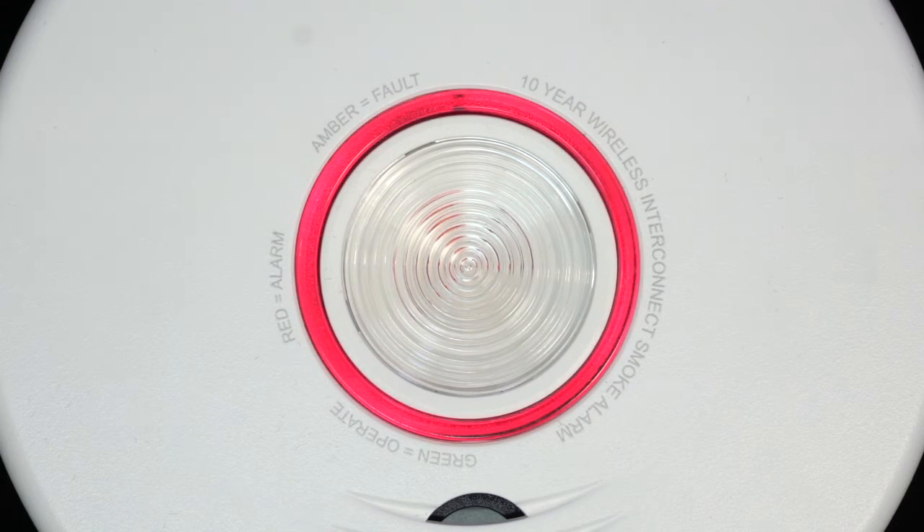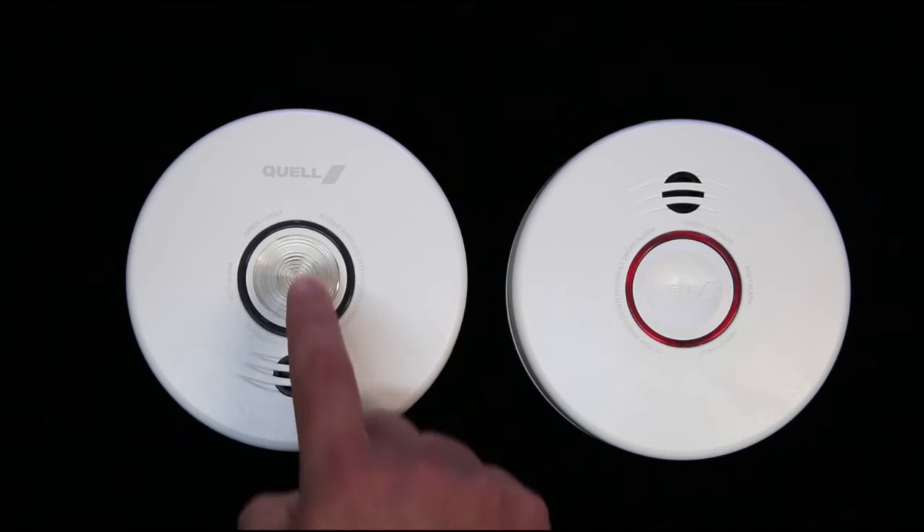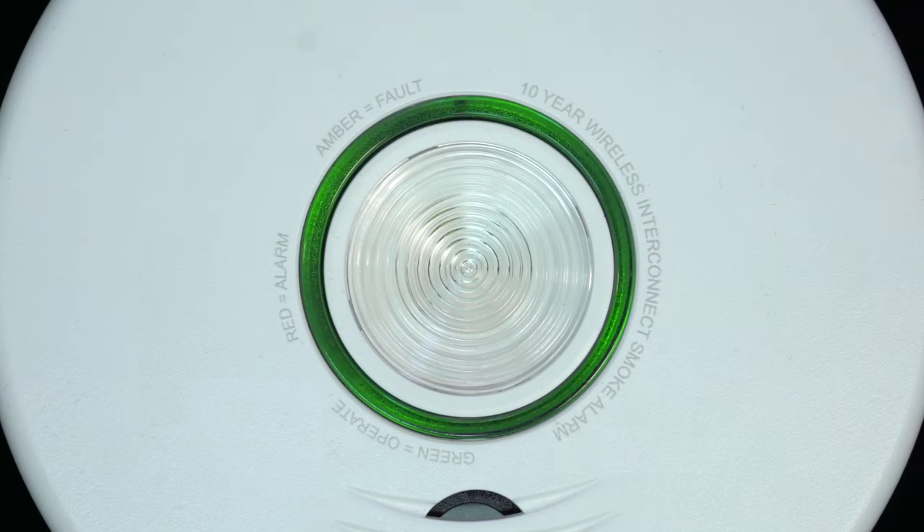Next, choose one alarm. Press and hold the button on this device until you hear two beeps, then release the button. You will hear "searching for other devices." The light on the device will pulse green and you should hear a continuous sonar ping until all the steps on the device have been completed. When each alarm connects, it will give an audio prompt that says "success, now connected." Remember that a green ring indicates that a device is connected.